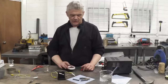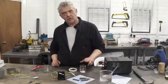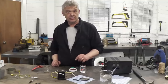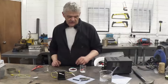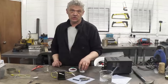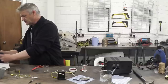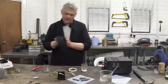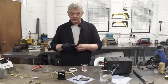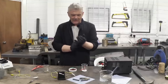This depolarizer was black copper oxide, which I've got here, and you make the paste using magnesium oxide, magnesium chloride, and black copper oxide, and you mix those in a ratio of 25 to 1 to 1. There's 25 grams of copper oxide there, 1 gram of magnesium oxide, and 1 gram of magnesium chloride, and you mix that into a stiff paste. Then that stiff paste is spread onto an iron sheet and allowed to dry, turned into a battery, matched against a zinc anode using the same electrolyte that we used in the Bennett battery, and you had the Lalande battery.